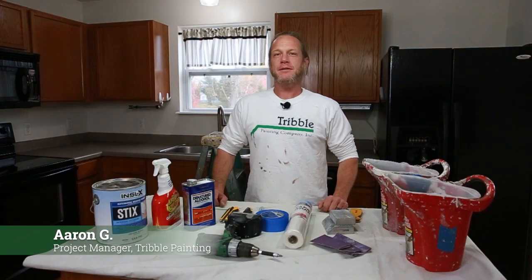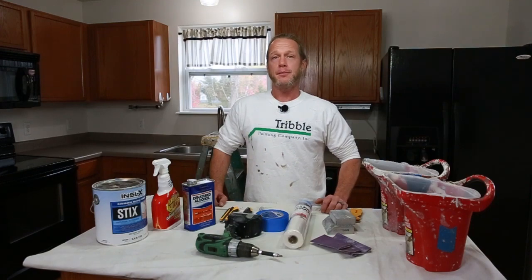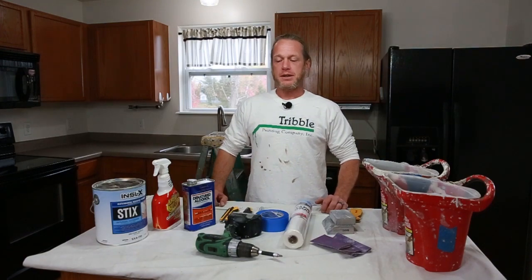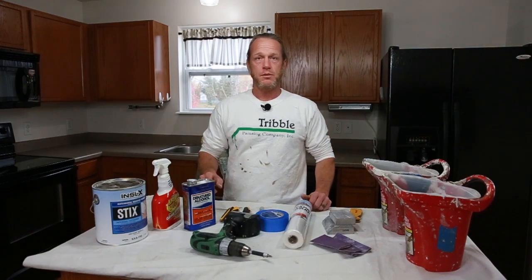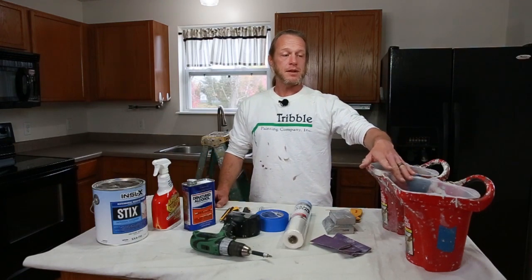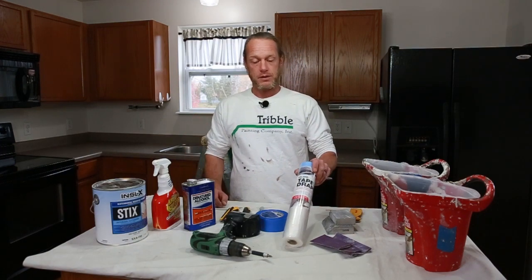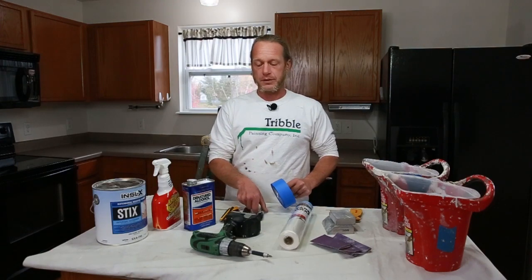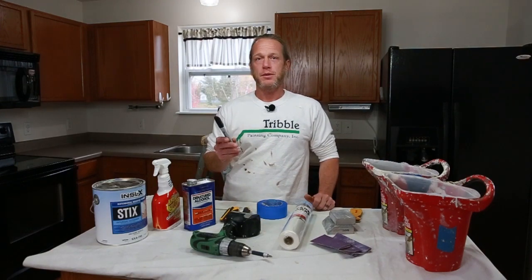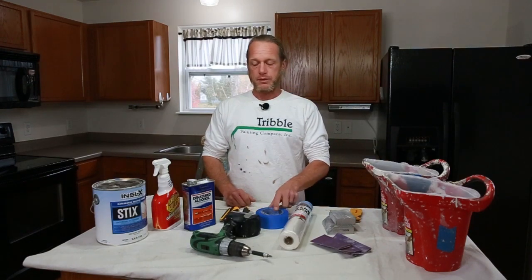Aaron with True Old Painting here. Now that we have our kitchen all cleaned out and ready for taking the doors and drawer fronts off, I'm going to give you a quick rundown of the items you'll need. First, you'll need a drill or screwdriver to remove the hardware. You'll also want some sort of container to keep all that hardware safe while disassembled. Then we are going to cover things up — sometimes we'll use plastic to cover over the countertops and stoves to keep them protected from our primers and any dust. We're also going to want to label all of the stuff we take down, so I'll use a Sharpie marker to mark those and some tape to cover up the numbers and keep them from getting paint on them.